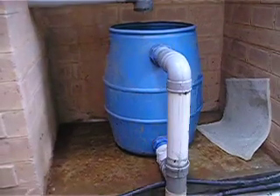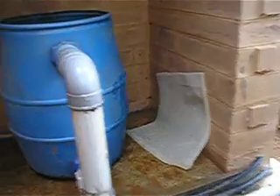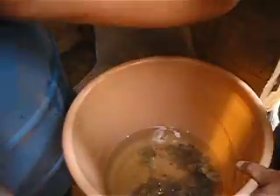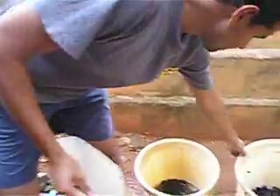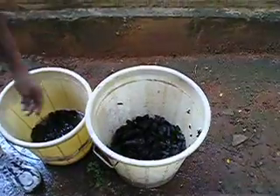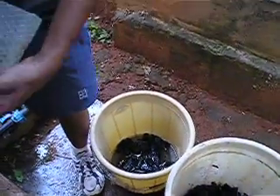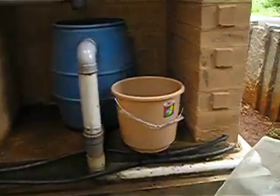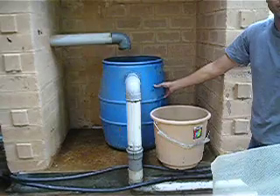So what does the filter actually have inside? That's actually quite simple. The filter consists of a few different layers. The first layer is a jelly — that's at the bottom. Once we place the jelly, we then place one mesh on top of that. On top of that mesh, we place charcoal — normal wood charcoal. Then on top of that, we place another mesh, which is already inside the system. And finally, we just place a set of heavy stones to keep the whole filter compact, so that when there's any heavy rain, none of it gets displaced. Quite simple.